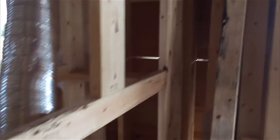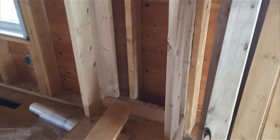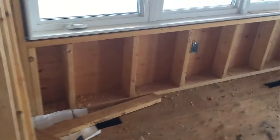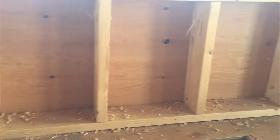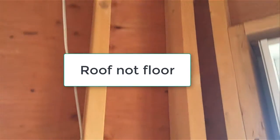It's easier to pull tape off and everything stays clean — you don't have to go around and scrape. When you get to the windows, you want to overlap the plastic and the tape to the stud so that on 360 degrees around the window it's fully sealed. You just need a few staples to hold it up there — you don't need to do 27 staples per window. Tape it so foam doesn't get in back and behind it. If you're going to be spraying your floor, it's a good idea to cover your floors up — nobody wants to go around and scrape floors.